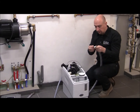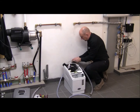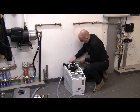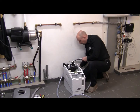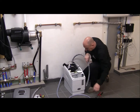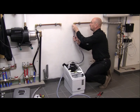I'm going to start with the inlet. I have these gaskets. First, I'm going to connect the flexible hose to the inlet of the water softener like this. You may want to tighten it — do not over-tighten it, but you want to tighten it. Install the other gasket on the other side, and I can simply screw it onto the three-quarter inch male adapter in the plumbing.